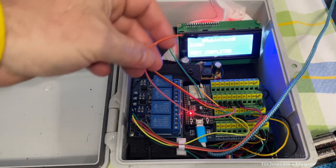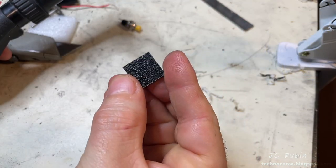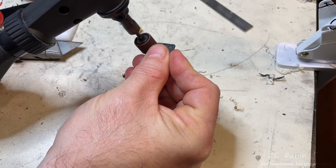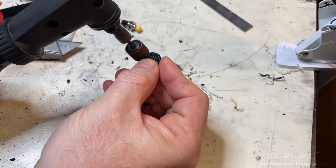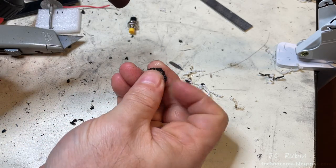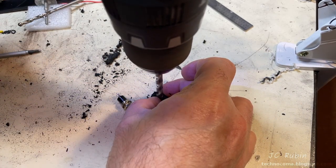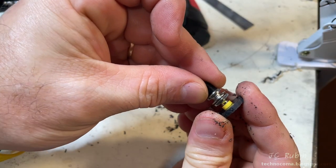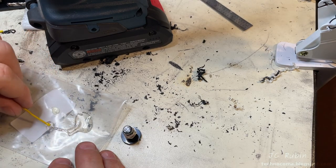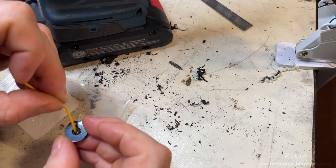This cable's GPIO needs to be connected to a button mounted on the board so it can be pressed through a small hole reachable from the top cover. I take a small square from spare pieces and round off the edges with a Dremel so there are no sharp edges that could catch on anything going through the cover — making it roughly circular. I then bore a hole to seat the head of the button. I scuff it up a bit for maximum adhesion with the epoxy I'm going to use, and then glue both pieces together.